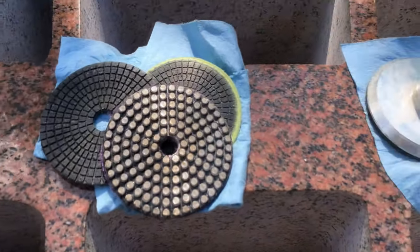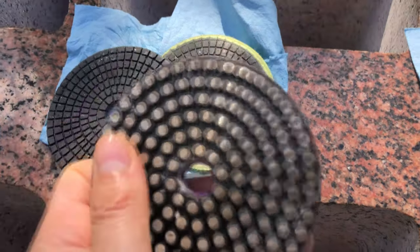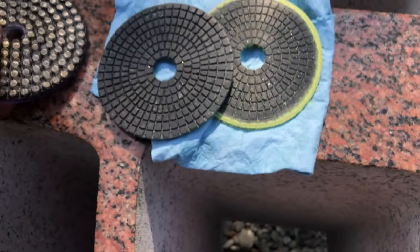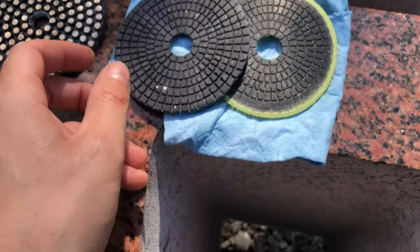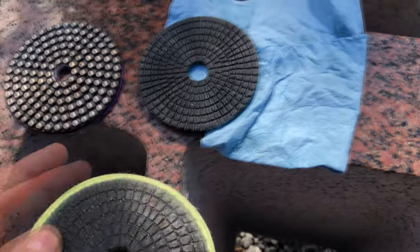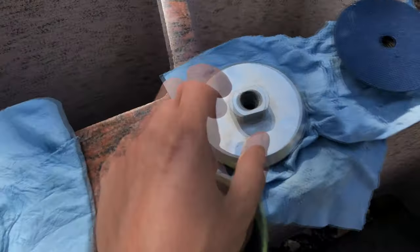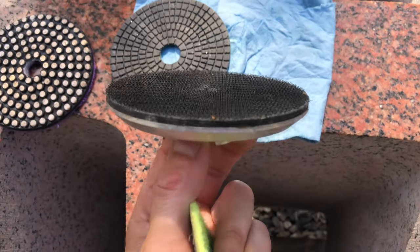One thing I tried new on this: after sawing, I tried a pad like this. It's flexible, but it's a metal matrix versus a pad like this which is a resin matrix — the regular polishing pad. This one is 30 grit, fairly aggressive, which is what you want right after sawing. I used this on all the edges and everything as well as the flats. For that disc I used an aluminum backer pad — a solid backer pad — to help flatten it out and get a nice even surface.